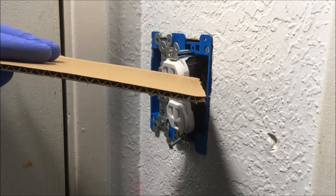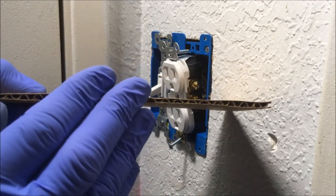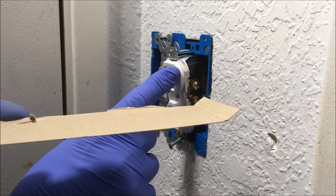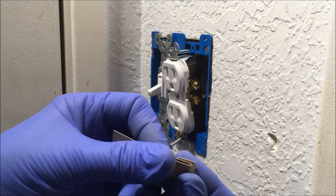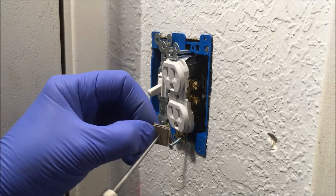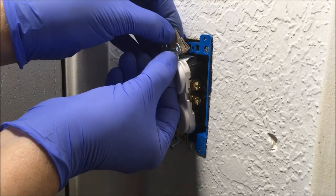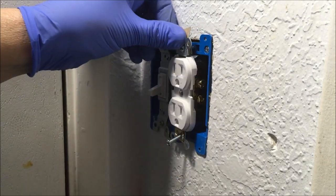You can use cardboard to make spacers, but keep in mind some cardboard compresses easily. You want cardboard that's fairly firm, that's not going to compress as much. This is a piece of cardboard from a cereal box — this is the best type to use when shimming a door hinge or making a spacer for an electrical outlet, because it doesn't compress. Take the cardboard and fold it until you have the thickness you need, then punch a hole through it with an ice pick on a firm surface. Push the ice pick through to widen the hole so you can get the screw on, cut off any excess, then screw the screw in.